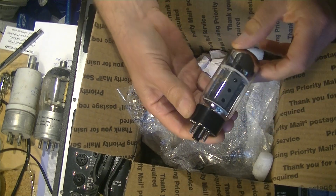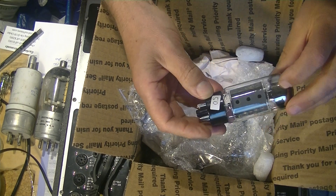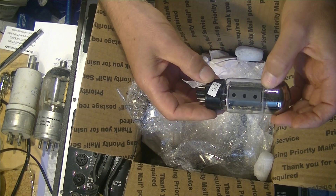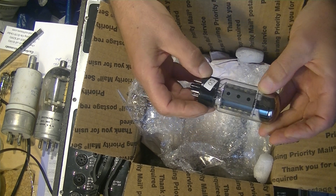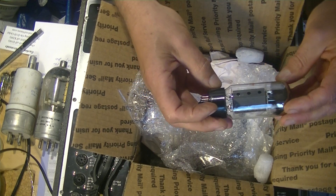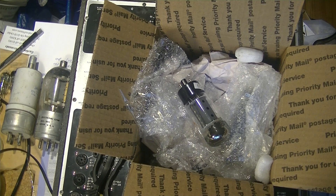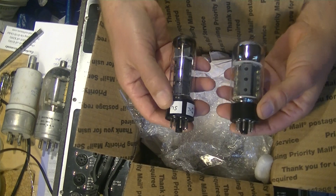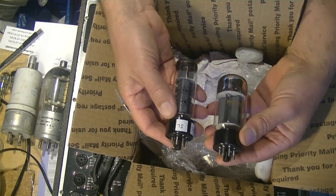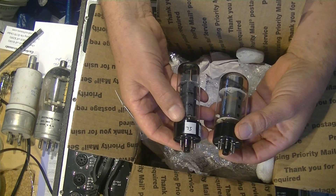Here's a beautiful looking tube. It says on here that it's a 6CA7, which is the North American designation for this power tube, and underneath it actually says it's an EL34. As we discussed in the previous episode on power tubes, this is an earlier EL34. That's an Electro-Harmonix EL34 in the modern configuration, and here is a vintage configuration — you can see there's a huge difference. The pins are the same; electrically it's identical and the specifications will be very similar.